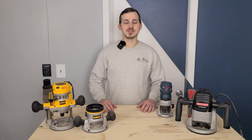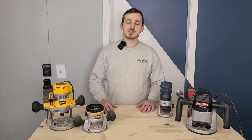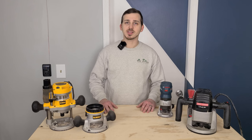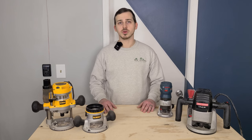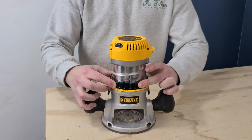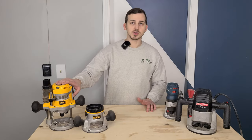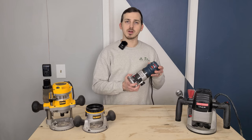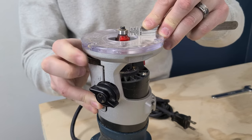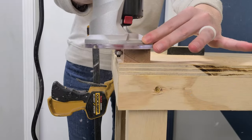You'll see a lot of woodworkers on YouTube using expensive Festool routers, but for everyday creators, those pricey routers might not be an option. We're all about having options for every budget, especially for DIYers, hobbyists, or newer woodworkers. We'd highly recommend the DeWalt brand — their new height adjust ring makes setting the height much easier than most other brands, and their collets always hold the bits tight. DeWalt makes an excellent trim router as well, but we actually picked the Bosch brand for ours, since it has a micro adjust wheel that makes it easier to dial in exactly the right height for corner profiles.